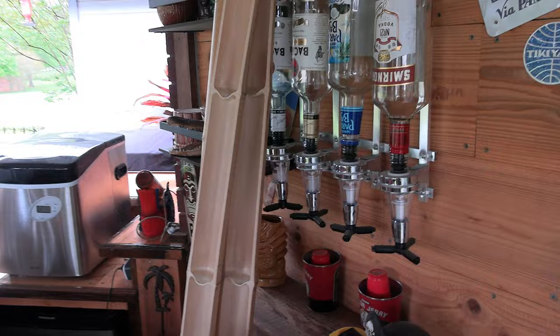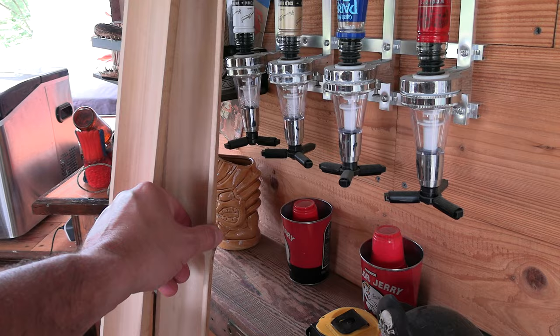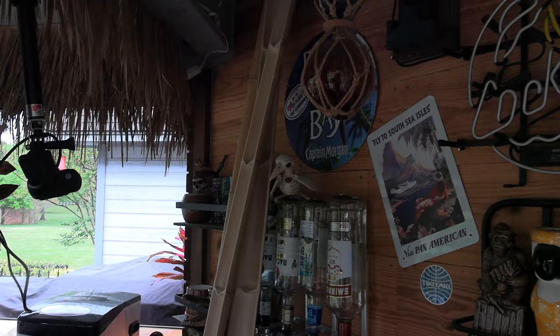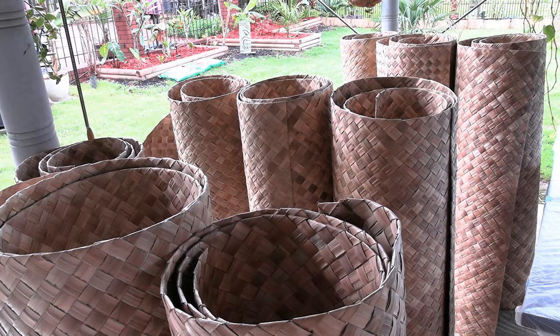Here are a couple of examples of the bamboo — it's three inches wide. I've got a whole bunch more sitting in the living room now waiting to come out here. These are a little bit crooked, so I've got them off to the side, but they're eight foot long. I'm going to be using those to bridge the gaps and also run around the outside perimeter of the tiki bar patio. Now that I've got my measurements, I know that I need to cut each one of these down to 69 inches.